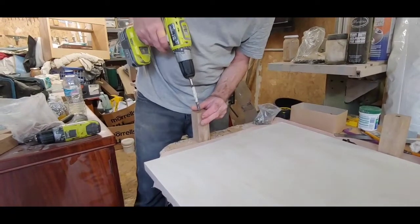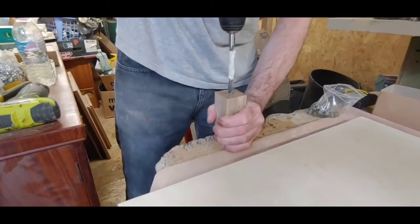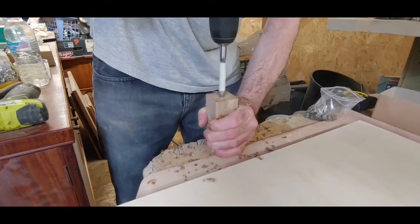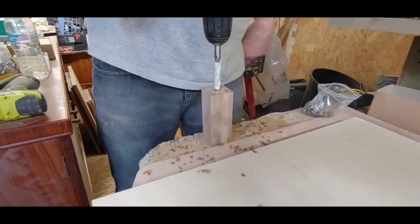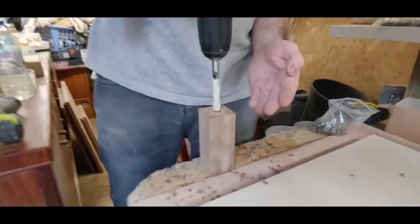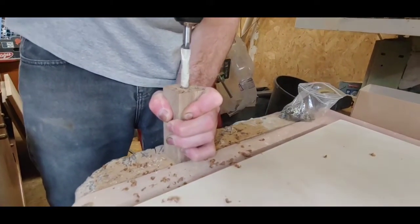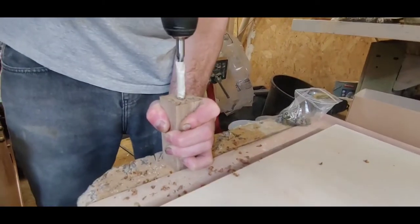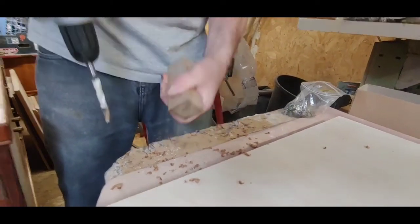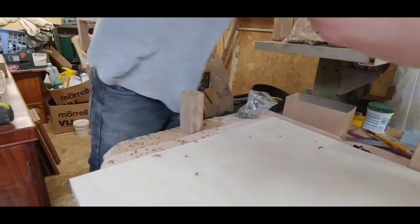I'm going to get that spot on the cross and put it on high speed. Now I'm going to wobble this around slightly because I find the 10mm to be just too small — this oak is extremely hard. You need it slightly bigger or you'll struggle to get the thread in. Just elongate it a tad. There we go — that's spot on in the middle.